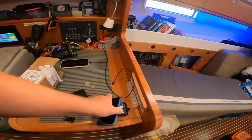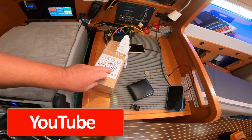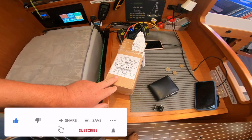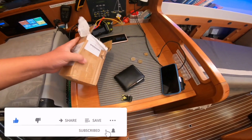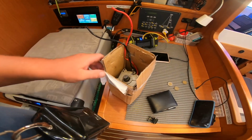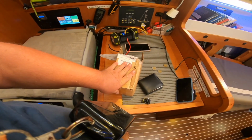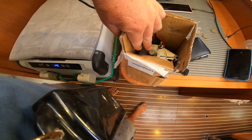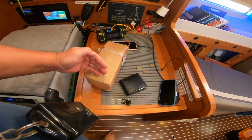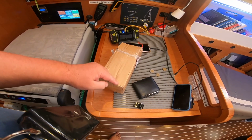Okay, so just before I finish this bit of filming, this is the part number that you want, 66000107, and this is for the 1000 watt Lewmar Pro Fish, I think it's called. This is from Cactus. They gave me the best price. Tomorrow I'm going to strip this down and have a look, see what's wrong inside. I've actually got another one of these. The other one has got that gear wheel there damaged, so we may be able to make another spare out of this one, because I'm pretty sure what's happening is the brush springs aren't pushing the brushes in, or the brushes are worn out.